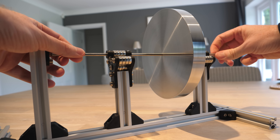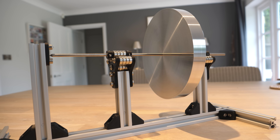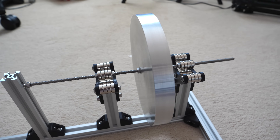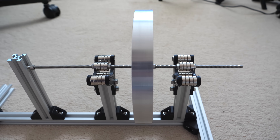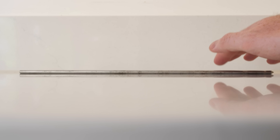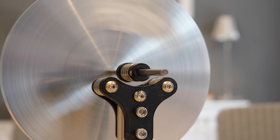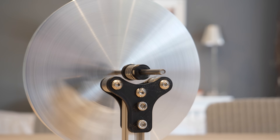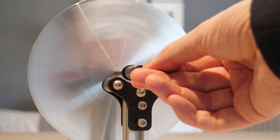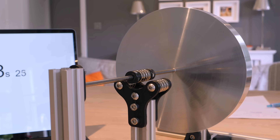And there we have it — a magnetically levitated flywheel. It's quite wobbly, which is due to a number of reasons. I initially built this with a threaded shaft to allow for adjustable positions of the magnets and flywheel, but they all seemed to be slightly bent. I then bought some steel shafts which seemed straighter, but I had to heat up the flywheel to fit the shaft through the centre hole and ended up bending the shaft by accident. I've now balanced it the best I can with some taped-on washers and it will happily spin for about 12 minutes.